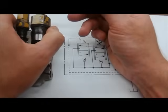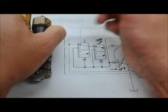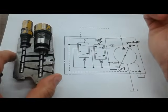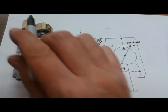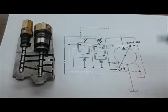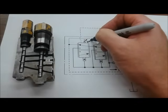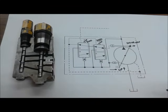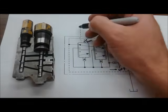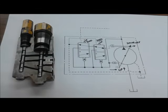I can see there's a lock nut and adjustment stem. I can unlock it and turn that with an Allen key. Of course, the cap's missing off of that one. The load sense control is also adjustable. What I'm adjusting here is this spring. So the load sense spring is also adjustable. And the typical setting for that in a load sense system is 300 PSI for that spring. But of course, varying pressures coming in from the DCV are going to work with that to control the load sense, and of course the delta P or the differential pressure of this pump system.